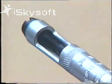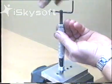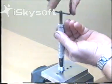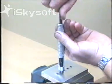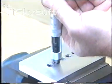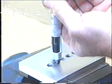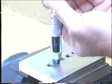Remember your thumb over the nozzle end. Place it over the hole. Don't hold the body too tightly. As you start winding into the hole, any misalignment will correct itself. Remember, do not push. Let the helicoil do the work. As you wind the handle, the pitch of the insert will follow the tapped hole.